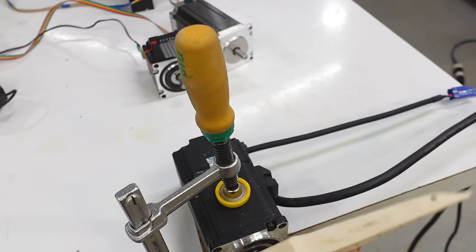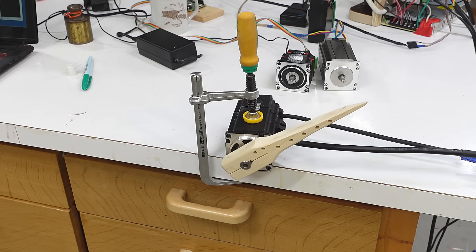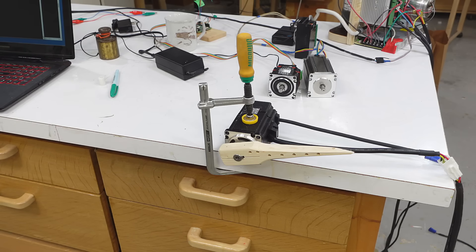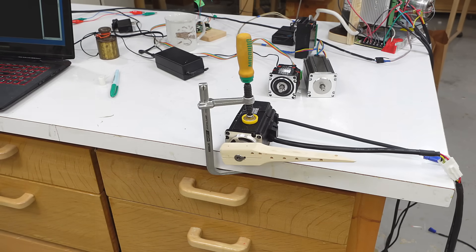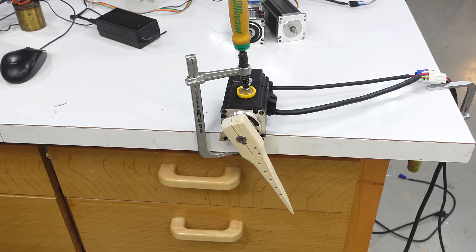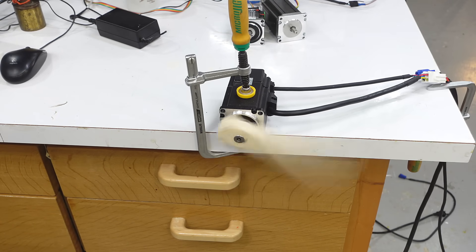To make it interesting, instead of advancing seconds like that, I'm going around the long way every time — basically doing almost a whole turn. You really can't see that move at 30 frames per second so I reshot at 120 fps and here it is at quarter speed. Looking at that in slow motion I see there's quite a bit of overshoot, so I tweaked my acceleration parameters, and that motion now takes 60 milliseconds to complete.